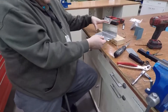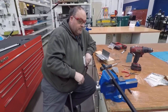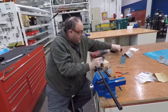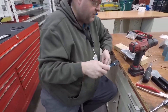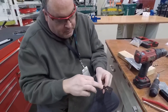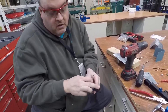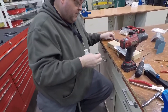The other way — if you do a lot of sheet metal fabricating where you're doing a lot of nut plates — you want to use a jig like this. I have a specialized jig here made for all different sizes of nut plates, because nut plates come in all different sizes. The way this works is it's basically got one side where it's just got a pilot — it happens to be a 7/64ths pilot — and then on the other side it's got the two pilots. I'll show you how that works.